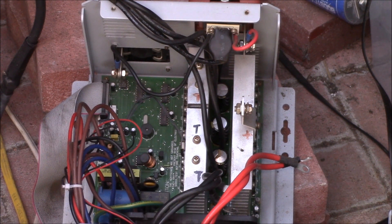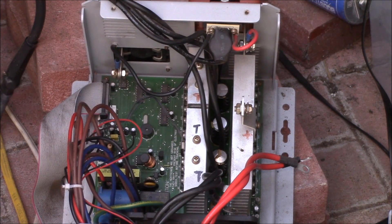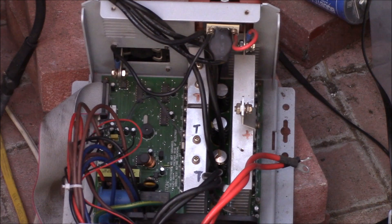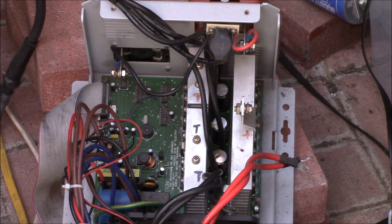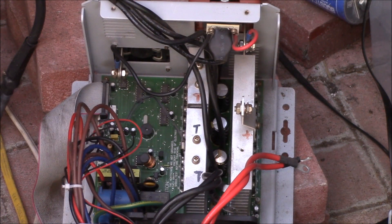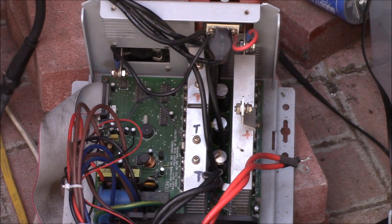I'm pretty sure this was caused by temperature. I'd been suspecting something failing for about a year because the unit made quite a loud buzzing sound that varied with load, and recently it was getting louder with more heat during operation. I think the capacitors were failing, causing more noise with the MOSFET switching, until it finally cut loose. So if you hear a heavy buzzing from a power inverter, it may be that the input capacitors are starting to fail.